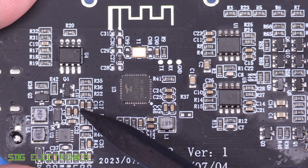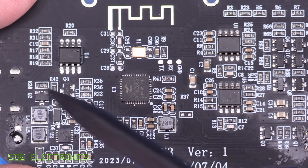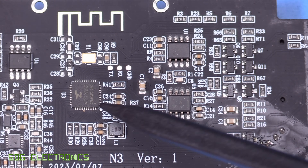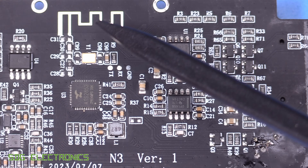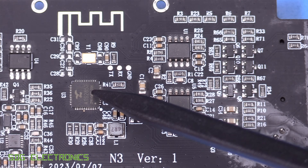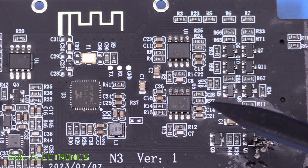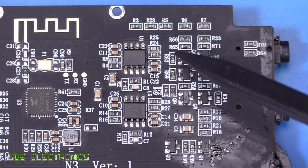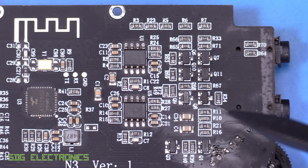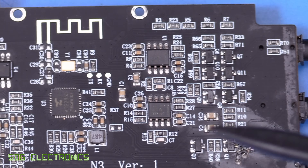Here's what the PCB looks like on the other side. We've got a multi-output DC to DC converter providing the various supply rails, and a linear charge controller for charging the lithium battery from the USB port. The main controller is the ATS 2853 — a microcontroller with a BLE 5.3 interface, with the antenna associated with that. It also has various audio peripherals including a 24-bit DAC, an ADC for the line input, and I2S interfaces. The headphone output has what appears to be a class AB amplifier stage with an op amp driving it for feedback, fed from the 24-bit DAC. The line input goes capacitively coupled into an op amp and into the ADC.